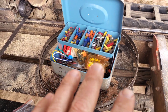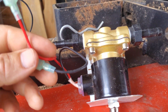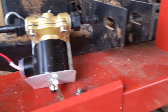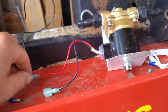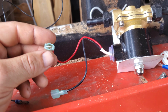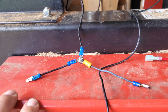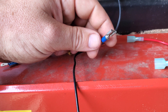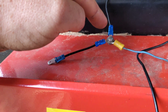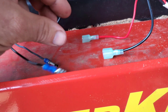I actually found in my shop my granddad's old electrical box — a whole lot of weird connectors. You've got your solenoid valve right here; black will be your neutral, red's going to be your hot. The black needs to go to the frame of the sawmill, and then the red needs to go to the clutch itself. So I came up with this — it's like a weird three-way connector. The male from the clutch plugs into here, this plugs into the actual clutch, and then this powers back to my red wire. I'll plug the red into that one, and that should work.